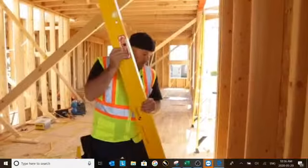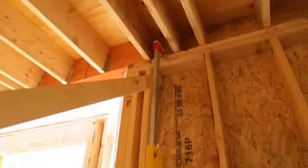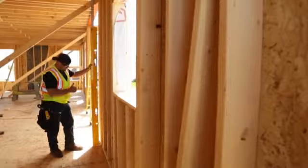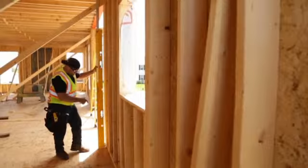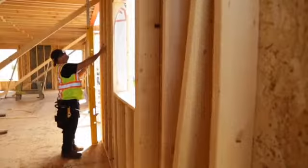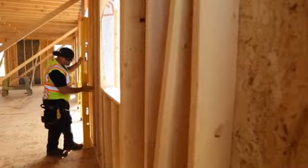As you watch, as I go ahead and plumb up this wall, you see the bottom and the top are firmly placed plate to plate. So now that we've set our plate level and locked it in at a 9'2" wall, top plate to bottom plate, you can see the stand-ups. What the stand-ups do is allow you to go around the stud. So if this level was above exactly where we had it start, the stand-ups let you go around it.